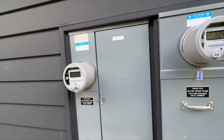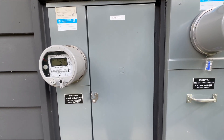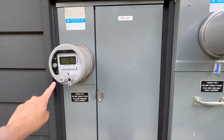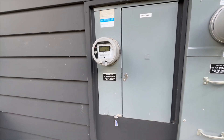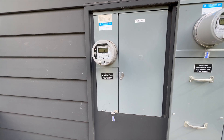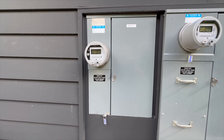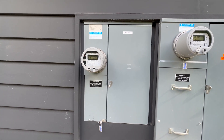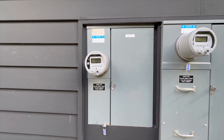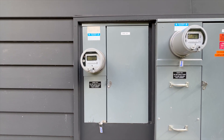The second panel is a second 200 amp service only for EV charging, and it's on a time-of-use plan which costs more during the day and less at night. For an EV that works fine because you can set the EVs to charge at night. The price differential is about a third the price between the highest and the lowest, so it's a pretty good deal if you know you're going to have EVs.